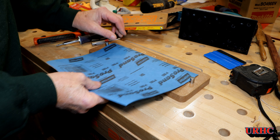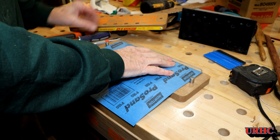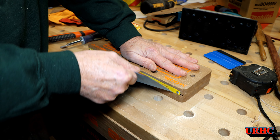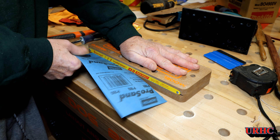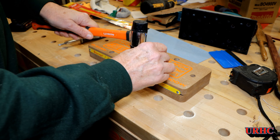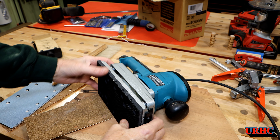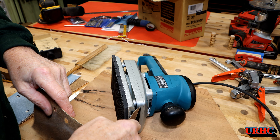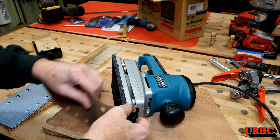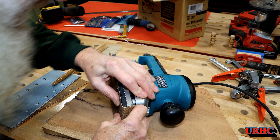Now I'm going to try a thinner paper — 180 grit. I turned it around so the hacksaw blade is out and you just pull it up on that blade. There's a little V behind it to let it cut well, and it seems to cut the thinner paper a little better. Same thing with the holes. Now I'm going to try this sander for the first time — it's a finishing sander, so it's really not made to use 80 grit, but I'm going to try some of that first anyway.